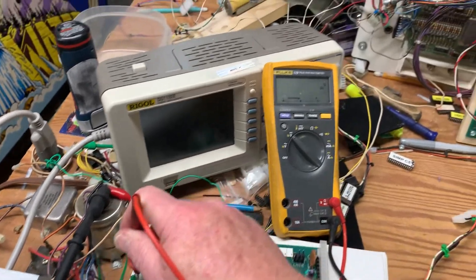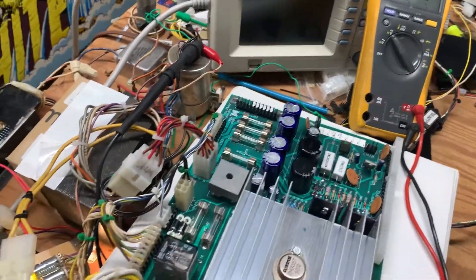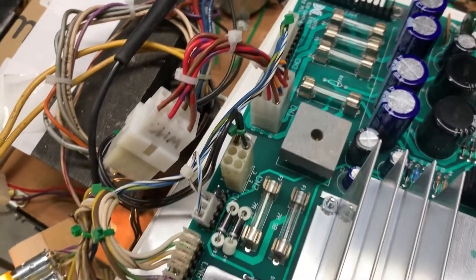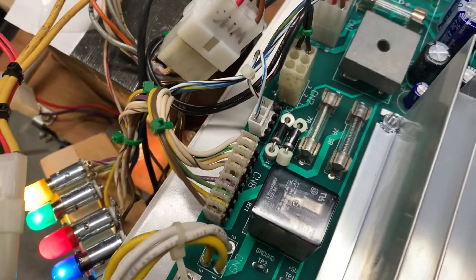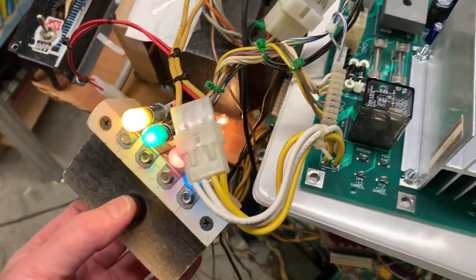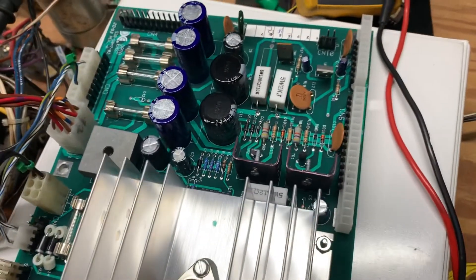I know the coil power is working since I'd already tested it with my GI tester. This little GI tester takes coil power from connector CN3 and it's switched by the three-pin connector, and then it switches this relay when I press the button on my little doohickey. So this power supply is now good to go for a long time.